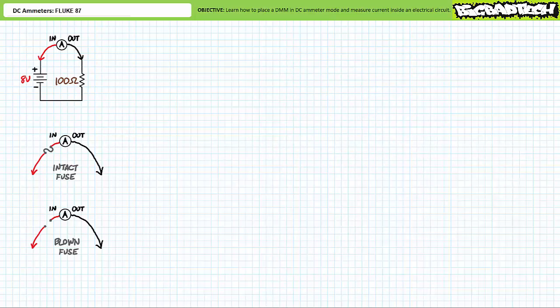Now I know you're smart enough not to damage your ammeter, but look around your lab. Do you trust any of them? My point exactly. Oftentimes in a communal lab setting where several groups of students share the same equipment, it's the previous lab group that has damaged the equipment and left it as an unwelcome surprise for the following group. If your ammeter isn't reading current and your inspection detects no other obvious opens, most likely the fuse for that particular input is blown. In this spirit, here's a quick guide how to test and replace fuses.